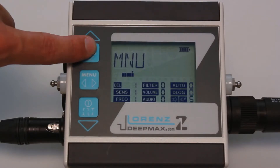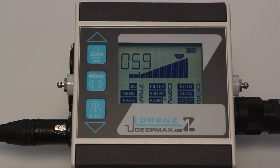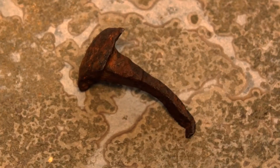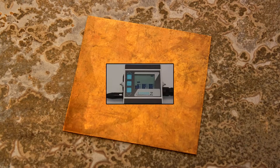Position five is for a double D coil. There are three distinct tones: a low beep tone for ferrous, a high beep tone for non-ferrous or large ferrous metal objects, and a medium beep tone for weak indications or small low conductivity objects. There are very fast settling eddy currents present — for example with small coins or thin plates — and so very low indications are displayed together with a non-ferrous indication. Ferrous metal objects with a range of 30 to 60 are typical. In some cases, large ferrous metal objects will give a non-ferrous indication but can still easily be identified as ferrous because of the number derived from the eddy currents. Metal objects with a very long duration of eddy currents, for example larger copper, silver, or brass plates, will lead to a very high time delay reading and a non-ferrous indication.